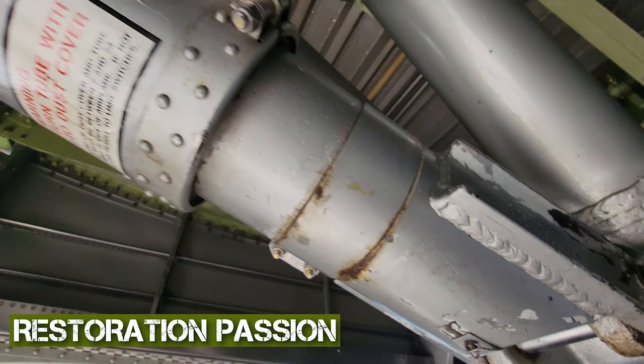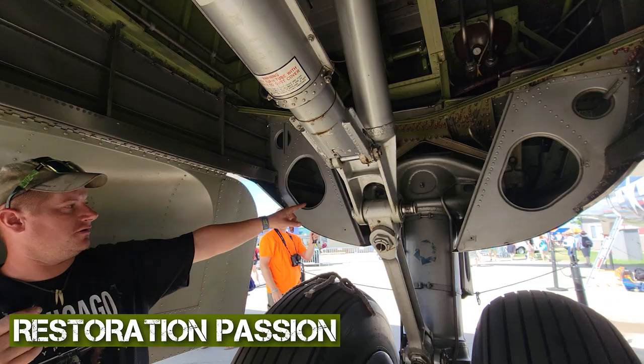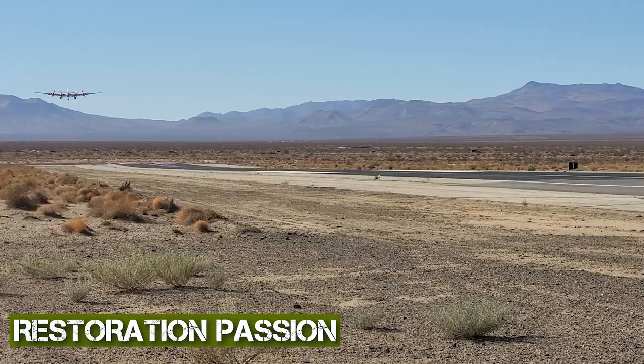This Acme screw extends, gear folds in half, there's the uplock up there. These massive wheels and tires come up in the wheel well while we're standing. And then your Schrader valve on the mast there, what's that? That's for the oleo strut, actually. That's pretty standard aviation industry stuff. It's a nitrogen charge over hydraulic fluid. Same thing B-17 has, B-24 has.